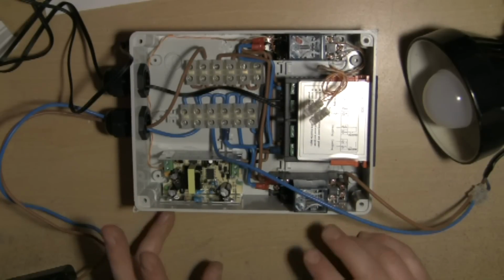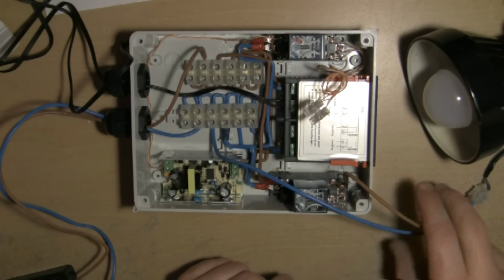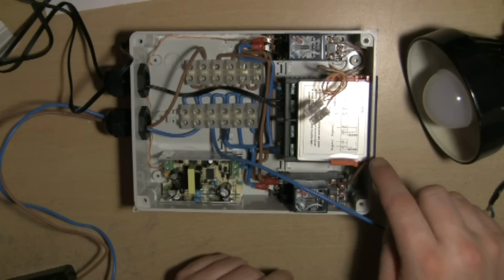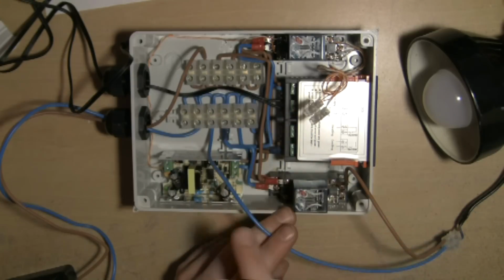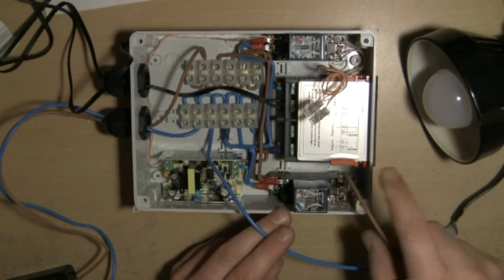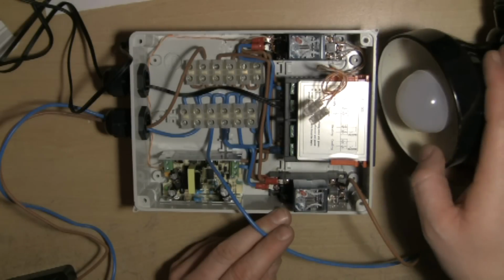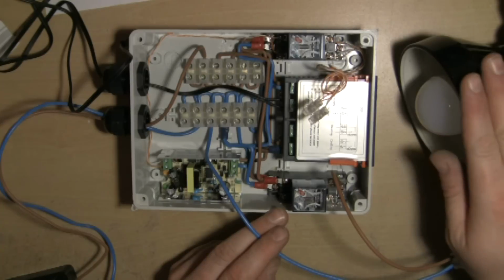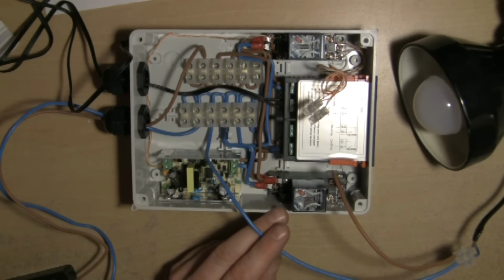Okay folks, you'll be able to see now that we've pretty much got everything wired up, and there are also a couple of extra cables in here. These 2 cables that I've pulled out here are actually replicating the glycol pump. So we've just got a neutral going down to the negative rail there, and live coming out of terminal 6, and then across here I've taken the plug off a lamp and wired it up. That's going to be our glycol pump for this little experiment.